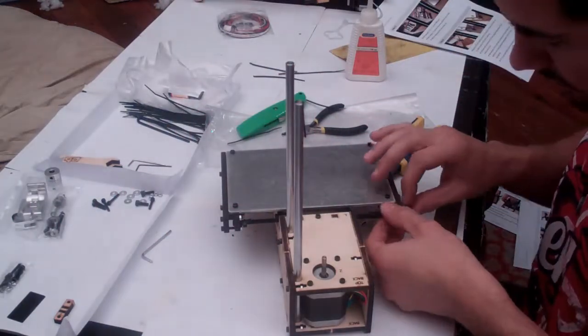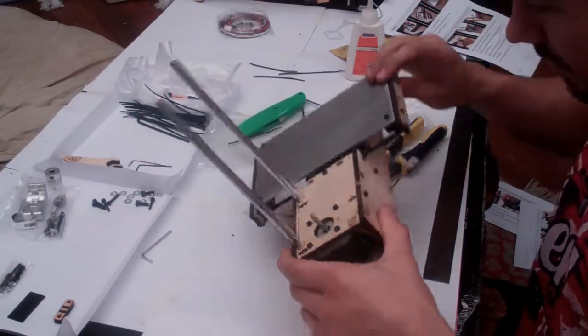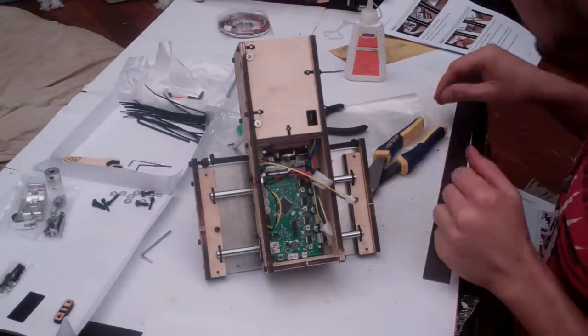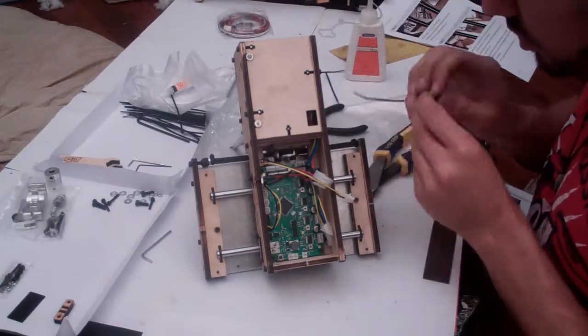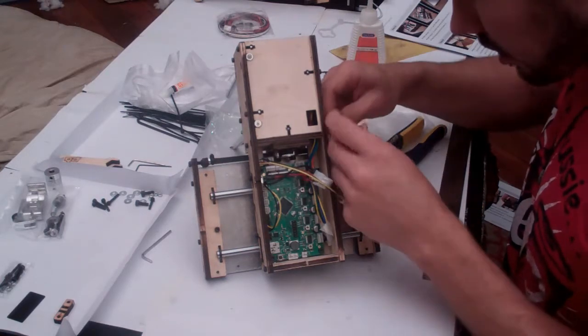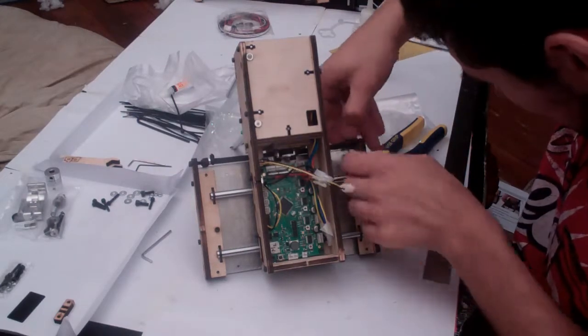And check, both your zip ties should have their fat ends inside towards the inner of the print bed. If they're hanging out the top, they're going to cause issues. So rather than lose your tuning here, the easiest way is to add a new zip tie next to the old one first in the right direction.